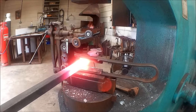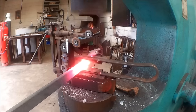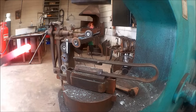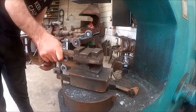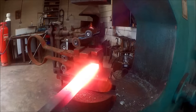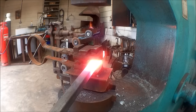You'll notice I've already skipped ahead and I've already created a leaf on the end of this bar, so I'm going to use this tool to cut the leaf off. The helpful part is that it's left me with a nice little point on the end for starting the next leaf. So this interesting tool is for forging the stems of both leaves and acorns — essentially I'm forging a round taper part way down the bar using the negative space of the tool.